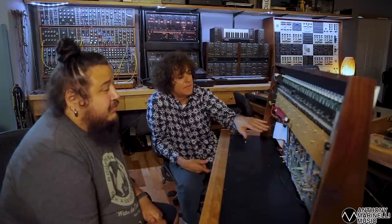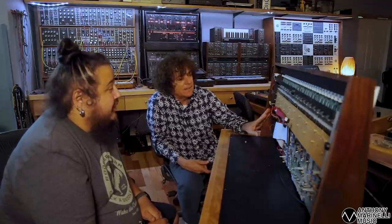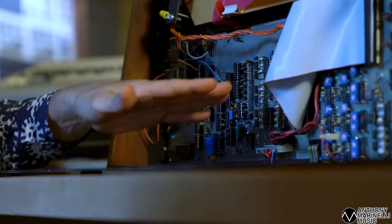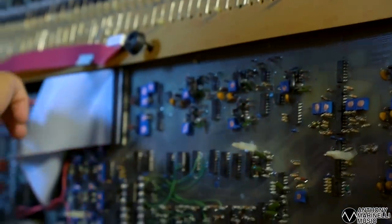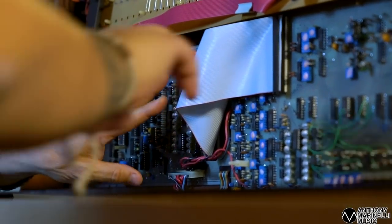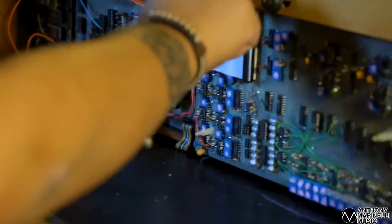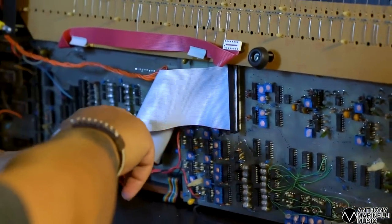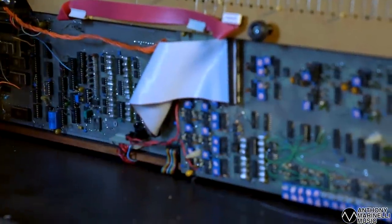So you have the Z80 microprocessor, and then it gets converted around here into analog. And then you have oscillators and filters and VCAs all over here - these are all just the control voltages for all of this. So it turns into analog land here. And then behind here you actually have the LFO, which is on its own oscillator chip, and the control voltage for that would be over here as well.